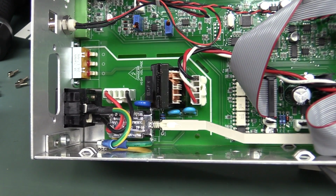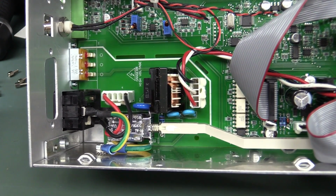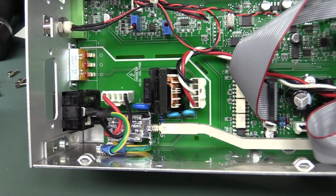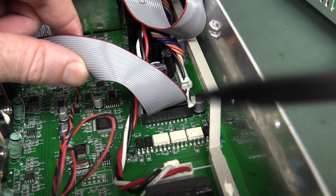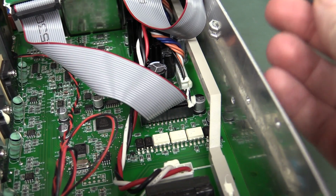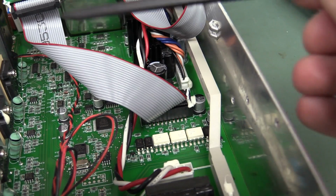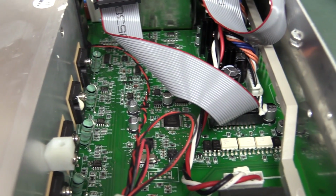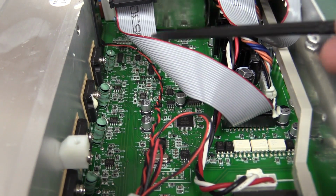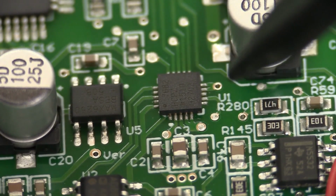They've got MOV protection there and a nice common mode choke. It's doing the business. Nice high voltage isolation slots. Excellent. And of course, there's all your digital isolation going over to your main interface board up the top here. So all the control circuitry and everything else is at the same ground potential as the input. And there's where all the measurement magic happens.